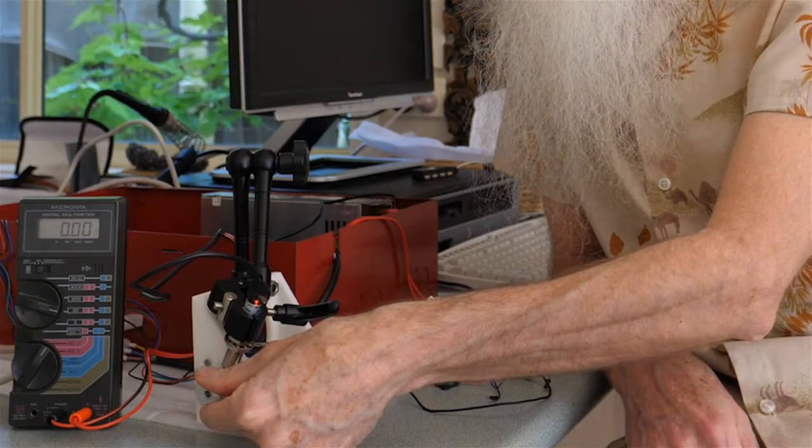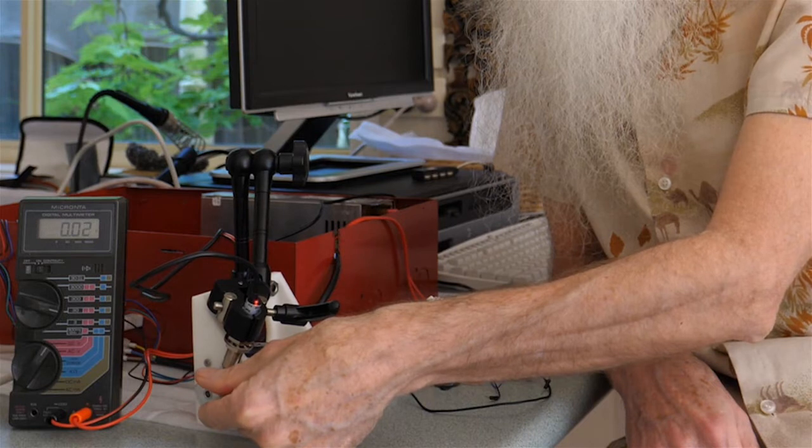When I come to do the programming, I want to find the position for the tools, so that needs to be fairly accurate. If you're looking at the light, you can turn it slowly — and I found that sound adds to it. On the automatic tool changer, I'm putting on a buzzer, so when it changes there's an LED flashing so you know to stand back — it's dangerous. I'm just going to have that on the air cylinder when it's activated, because if I had it on the pulley, every time the pulley went around it would make that noise.